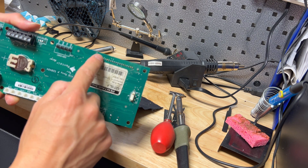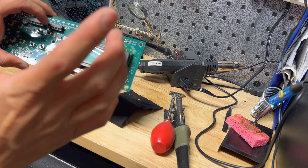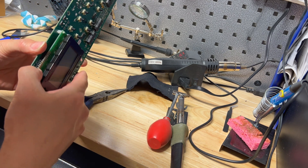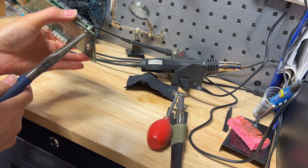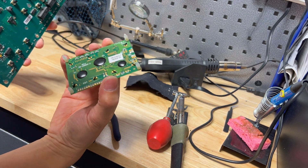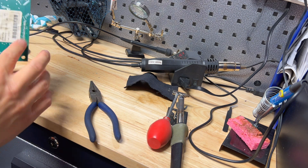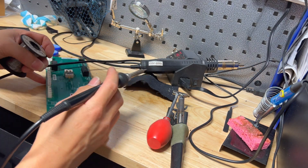On the bottom I'm going to go ahead and re-solder those back to the way they were, just to hold again. On the top we're going to clean it up with some solder wick to get everything off and then this thing will pop right out. Once you get it all loosened up as much as you can with the solder wick, just wiggle it out and kind of break the remaining solder joints. This last pin was the biggest pain — I had to cut it off — but it popped out and came right off. Before you put it all back together, clean up the pads with some solder wick to get the old solder off. I should have just started from the top from the beginning — that would have saved a bunch of time.